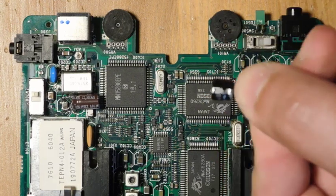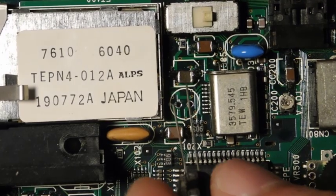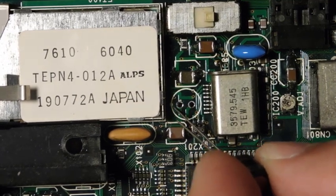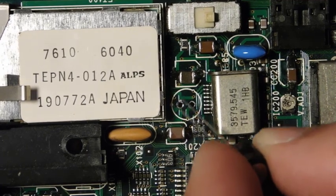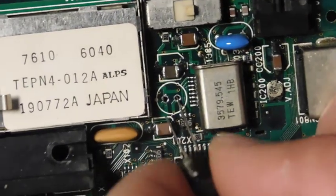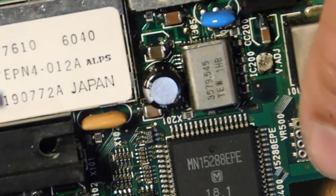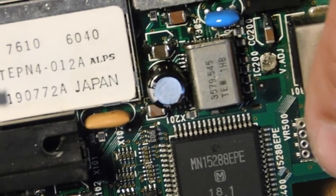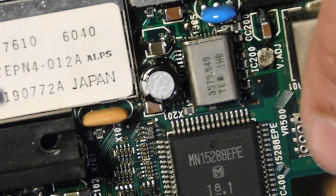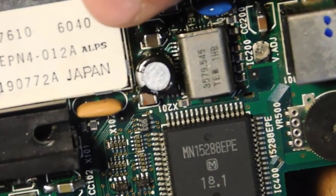Here's another 220 microfarad capacitor I'm going to put in. There's a little tiny dot on this circle here showing where the cap is going to go — that dot indicates where the negative part of the capacitor goes. Not all of these have that kind of marking, but fortunately these do. Another thing is that this board is so tightly packed that some of these caps aren't even labeled. So you have to be very careful when you do a recap of this board — take them out one at a time, match the capacitance and voltage, and put them in. It's a slower process than something like a Game Gear where the position of everything is very well defined.